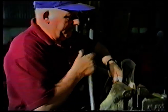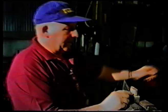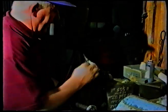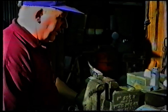Still just a little bit. It's got to turn this way just a little bit more. Actually cut this off. Don't forget to cut it proud, of course. It's pretty hard on the saw if you don't. And you need it proud to have a safe handle when you've got the wedge in.